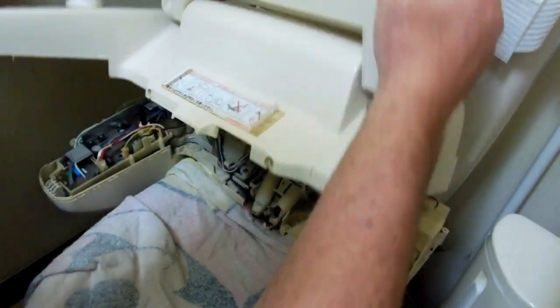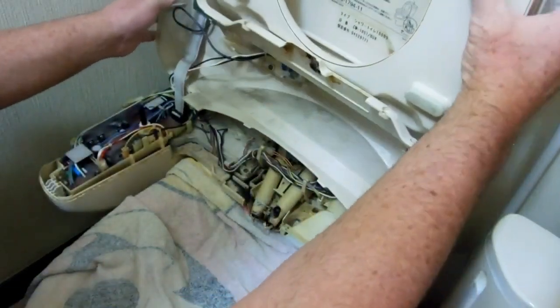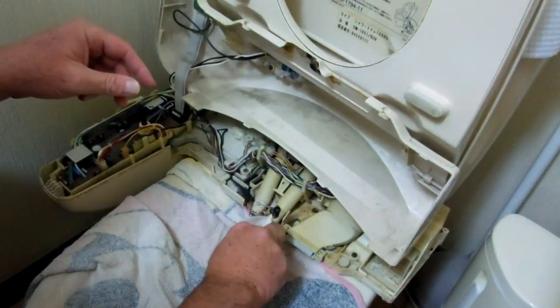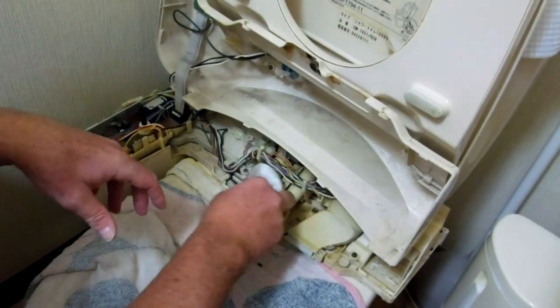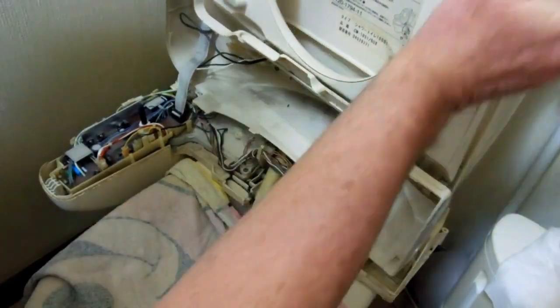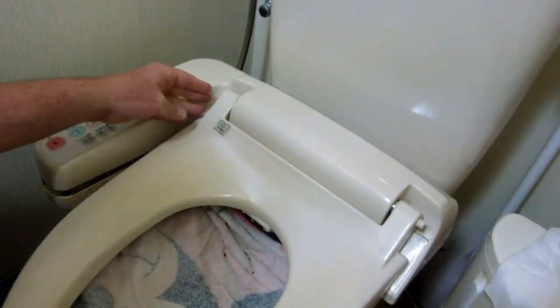How complex is this? It got scarier and scarier — oh no, look at this, look in here. So you can see a bit of black stuff there. It seems that the little slow-closer is the problem. Somehow the cap came off it — it must have had some piece that held the cap on. And it would have had black silicon grease inside it and that's gone everywhere. So that's what that messy black stuff is all over the place.